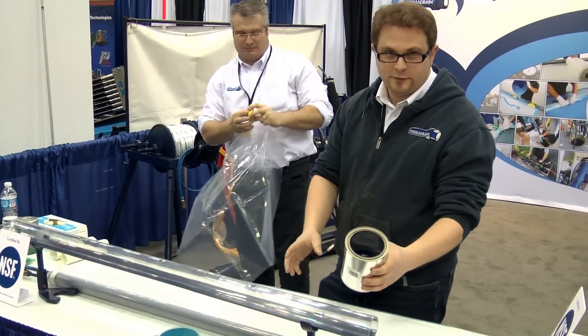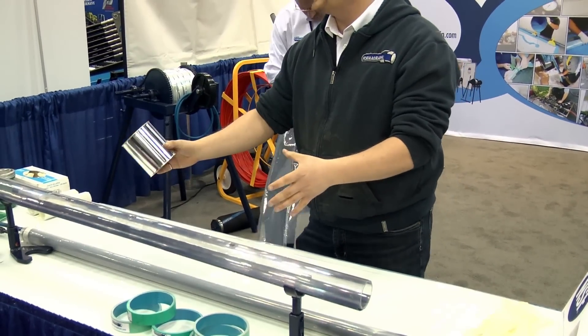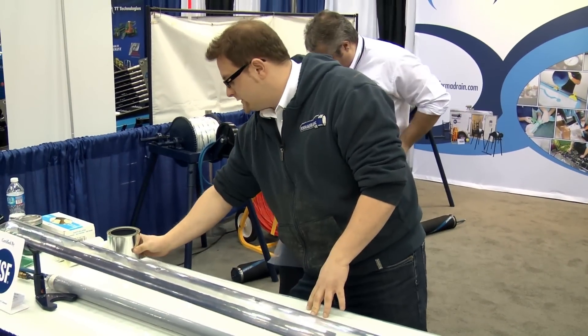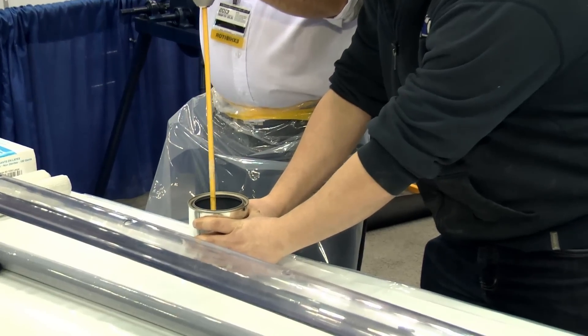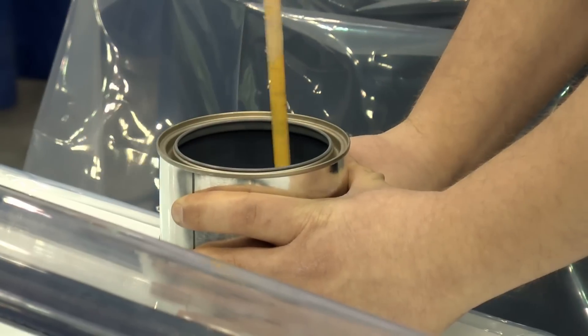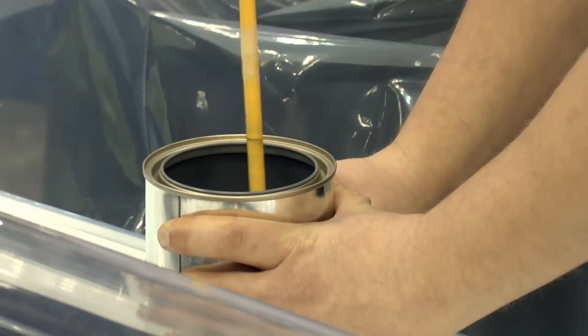You can see it's a two-component epoxy resin. You've got a blue part and a white part — that's the hardener and the resin — so we're going to mix it into a pale blue color. The benefit of the two color components is that once the color is homogenous, you know that it's mixed well.